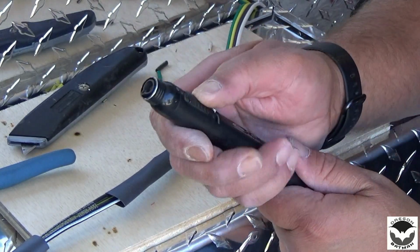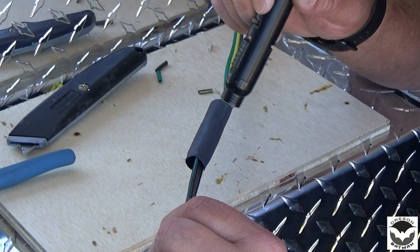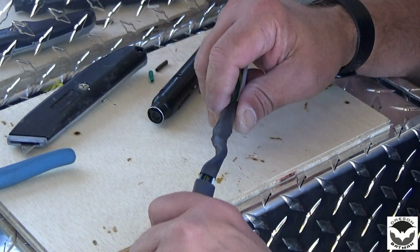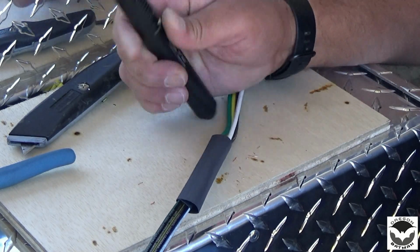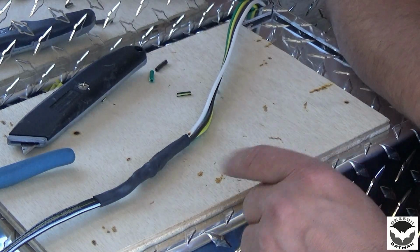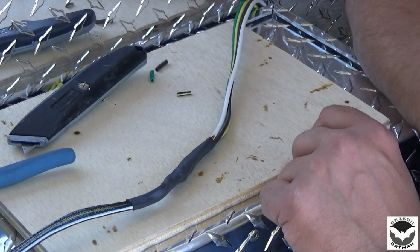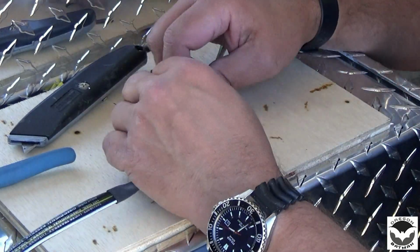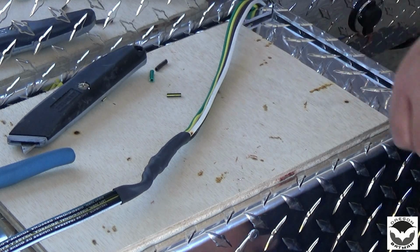Well, for you it was a split second. For me, a few minutes. So let's see if we can't get this one heated on. Slide this one over top of that one. Give it a little added security here. And we'll let that cool down for a little bit, and then we'll push our stick back through our tongue, tape the end of our connector here to that, pull it back through, and that part's finished. I think we'll end up putting some, what is that, tubing over top, wire loom there on the back, and we'll be able to call that one good. So let's fish it through.